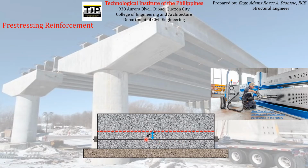Take note again, the length of the pre-stressing reinforcement is smaller than what you are seeing here. The natural behavior of steel, the pre-stressing reinforcement, is that it tends to go back to that original length, which is shorter than what you are seeing here. But the concrete again prevents it from doing so. And because concrete is preventing the pre-stressing reinforcement from going back to its original length, the pre-stressing reinforcement is imposing what we call a compressive force to the concrete element.